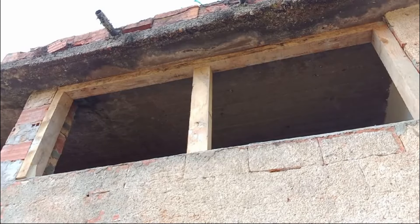As you can see, this is from the outside. I've got the top of the frame in now and both sides and a centre post. I've got to line those up a little bit. I ended up making them a dead size and hammering them in, so that's all nice and tight. I might have been a bit premature on my mortaring that bottom one, because that's moved and cracked a little. I'll remortar that tomorrow once everything's in position and screwed tight.